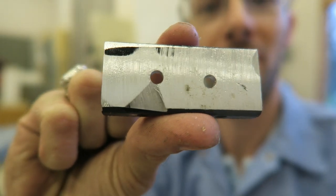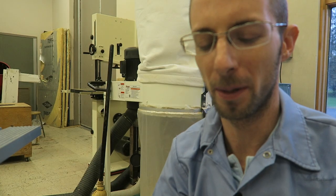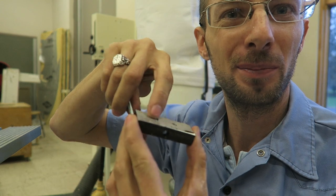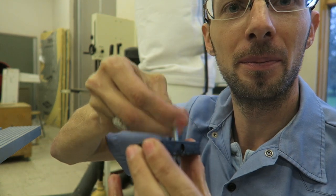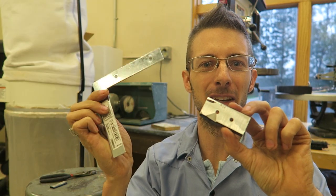That's what my surface looks like right now. You can see I've got a little gouge in there. That's not going to affect it one bit. After I ground it down flat though, there was a little slag in my holes. What I did, I just take my pan head bolt, run it in and out of them a few times, cleans it right up.